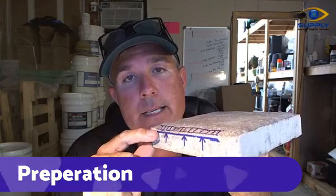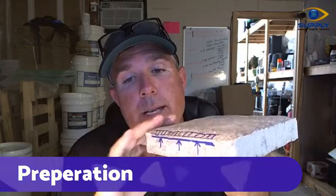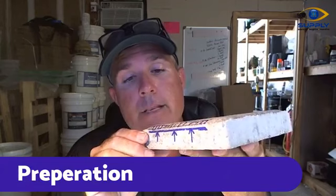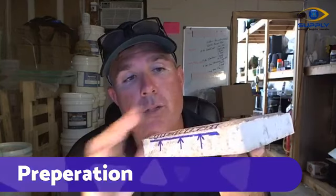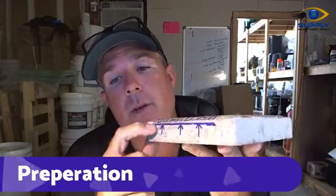Now, people use wet sanding techniques, and they use dry sanding techniques. You want to blow off any of the residue that's on top of these pavers, whether you sweep it off or blow it off, but just get it off. Because if you put that sealer down on top of it, you're going to actually seal those grains of sand on top. Typically, when we dry sand, we get the sand down to the level that we want. We blow it out to a side, and then we vacuum it up with a wet vac. That allows us to get all of it, and then blow it all off. It does a pretty good job. Of course, wet sanding is what we also do. So you can see that's where the line is supposed to be.